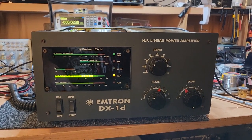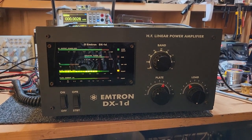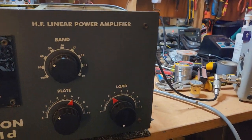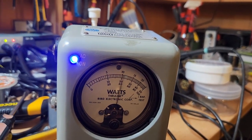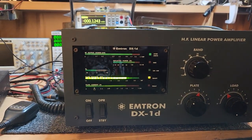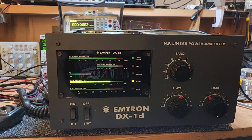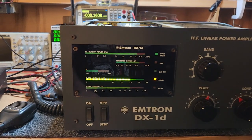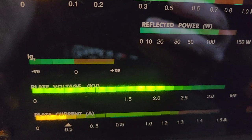I still think there's something wrong on the timing circuit. All I'm doing at the moment is literally running it up and making sure it's loading correctly and checking the power — seeing that it does what it should do. That all looks very good. The thing that worries me a little is it's a bit lower on its voltage, and this could be because someone's had a play with it. There are a number of adjustments for different things that can cause different problems. The HV voltages look fairly good, but this meter doesn't actually represent what's happening — see how it's dropping back.